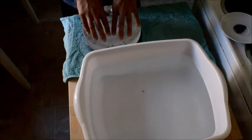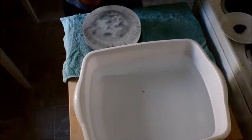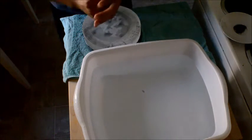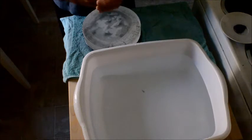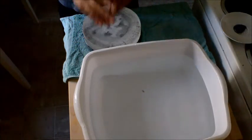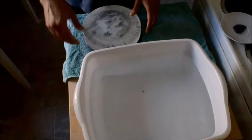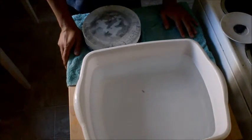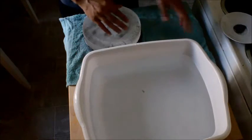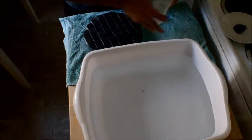After I do that a few times, eventually I'll notice that there's not as much resistance, and that means that the silicon carbide has ground down into fairly smooth spheres instead of just being these gritty grains. When that happens, that's why I have the bucket, and I would dip the glass and the tool in the bucket to wash off the used grains, and then rinse and repeat. I will be doing that for the next 50 or so hours, as long as I don't make any mistakes. Obviously, if I do make a mistake, I will have to go back and do some stuff again. So hopefully I will check back in 2017 with a brand new mirror.